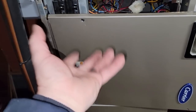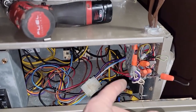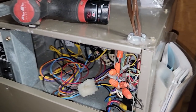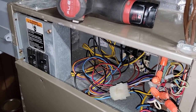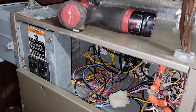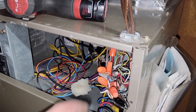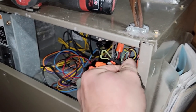There are a couple different philosophies here. I've seen two different ways of doing this. The blower is like this so it's sucking air through the evaporator when running in heat mode. I've seen them stage the electric elements so they bring them on as it gets colder to supplement the heat. Back in the day we didn't have all this fancy ECM blower stuff that automatically steps down as it gets colder - so we did it with outdoor thermostats, old mechanical ones like that.